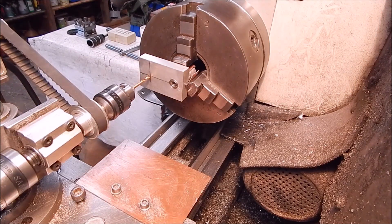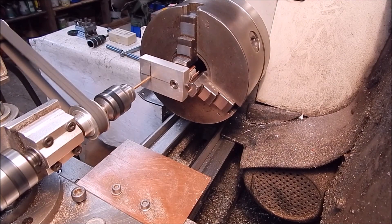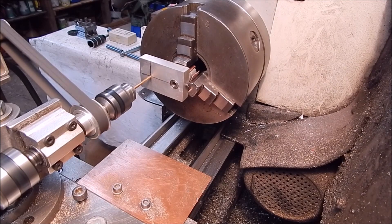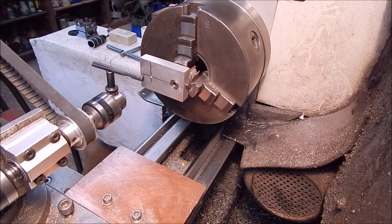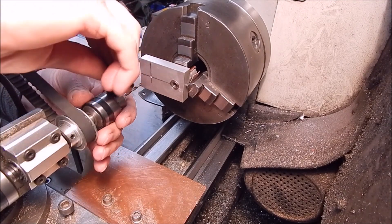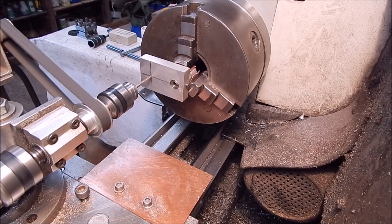Put on the light — that might make it easier to see. Then we'll start up the drill and bring it in with the tailstock. I'm just spotting this with a spot drill first. Okay, so we've spotted that — dead on line, dead in position. Now we'll put in the drill we want to use. Turn it up for the carriage. Now we'll push with the tailstock and she'll go in.